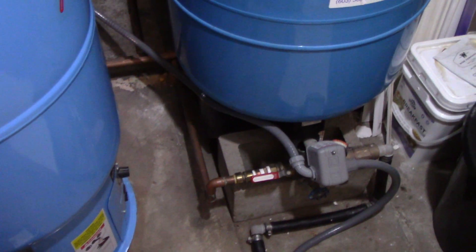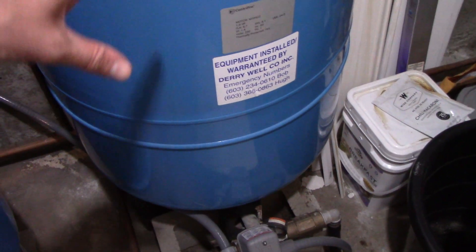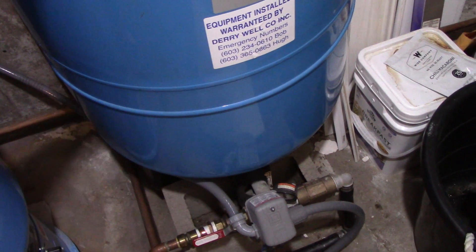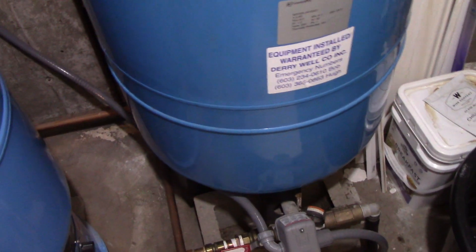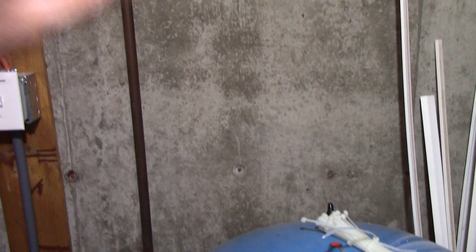What I have now is a bit of a mess. We've got the main line coming off the pressure tank here. What this basically does is accumulate water from your well — there's a baffle in the center and it uses air on the top side that gets compressed, allowing you to keep a nice steady pressure and not cause your pump to constantly run. That flows out through a three-quarter inch line, tees off at the bottom, comes up and makes a right. We're going to mount everything up on the wall here, so the first step is to put a board in place — that allows you to move things around a lot easier than drilling into concrete every time.